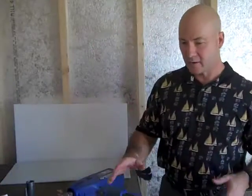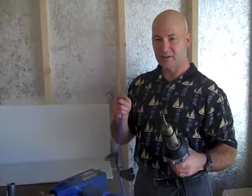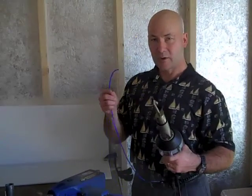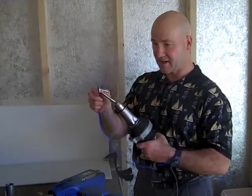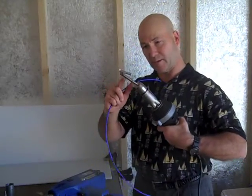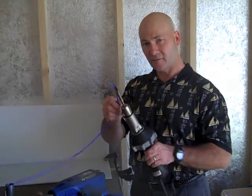When you're starting out in welding, this is your low-cost option. This is for short welds, and pretty much you can do all the kind of welding you need. You would need a Speed Welding Tip, which we have here — it's our little V-tip. It blows the hot air through one side, and then the rod feeds through the other side.